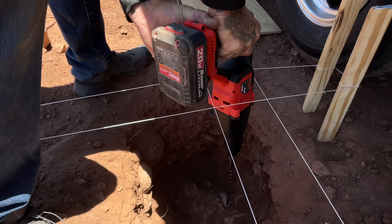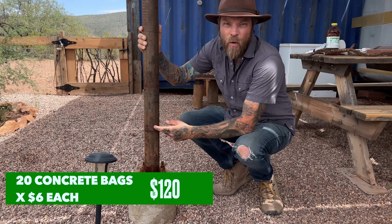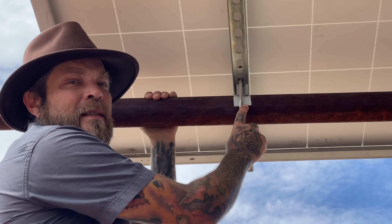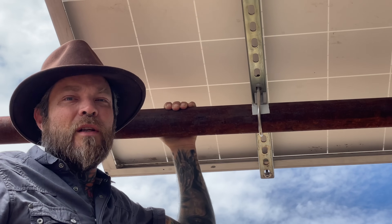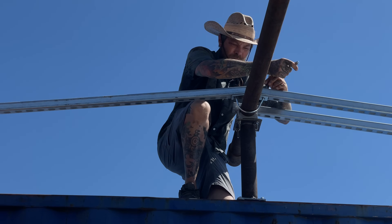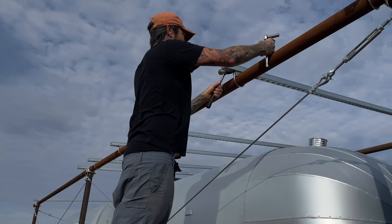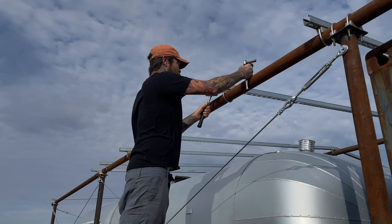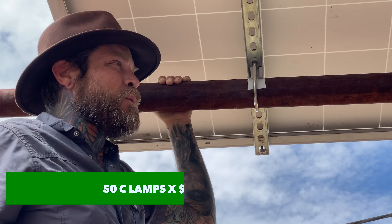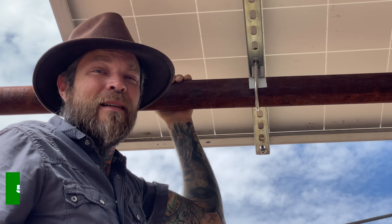We used about 25 bags of concrete. The posts go way down into the bedrock with rebar cages inside, and we used threaded J-bolts to mount the poles to the concrete so they're not going anywhere. Then we used stainless steel U-bolts from DX Engineering — they make ham radio tower components — at $15 a piece, and we've got about 40 of them. We wanted the structure to be modular so we could change or reconfigure it down the line.